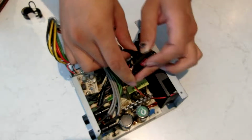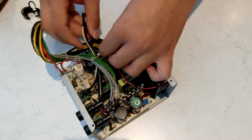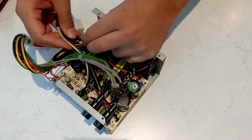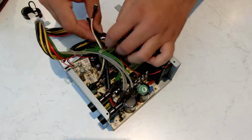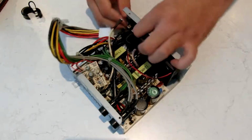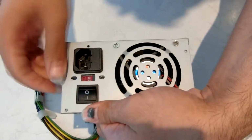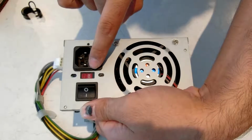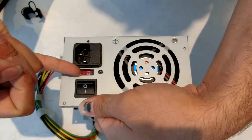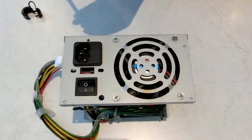This voltage selector switch, this piece here, you have to run it between these two loops for the mains input and put it up against here. So it's typically set up so that when the switch is that way and it says 230, the switch is on this side. Use the longer fine screws.